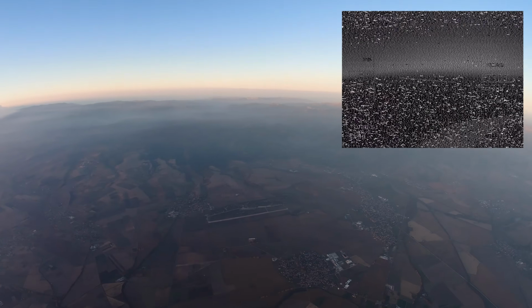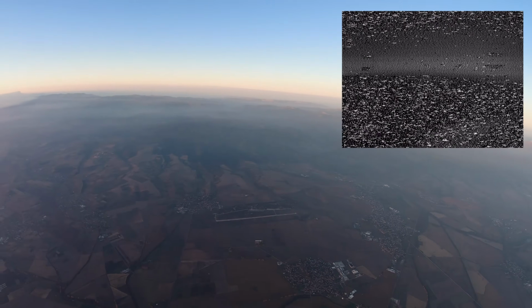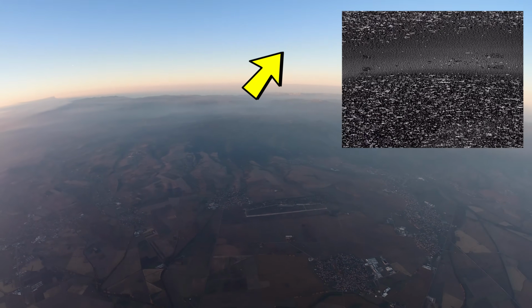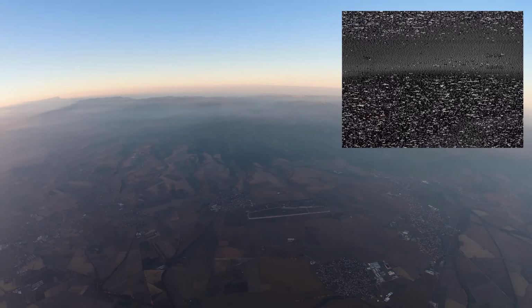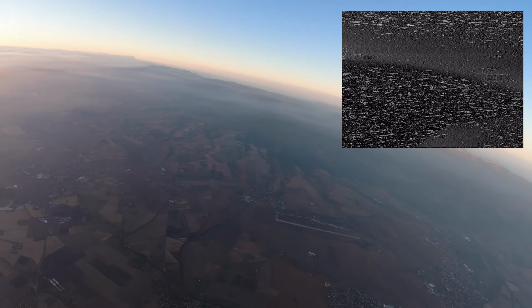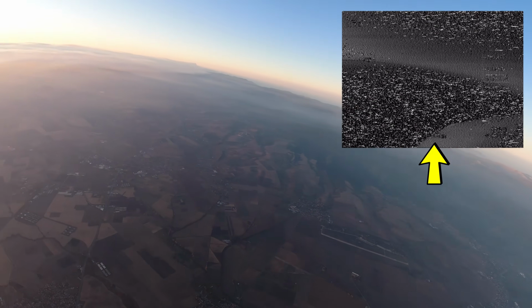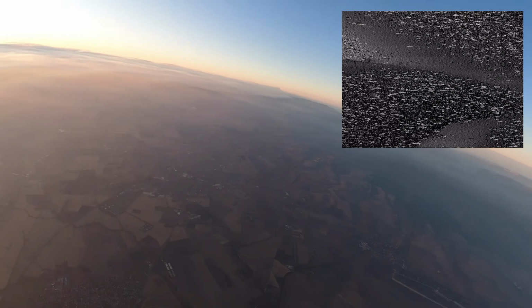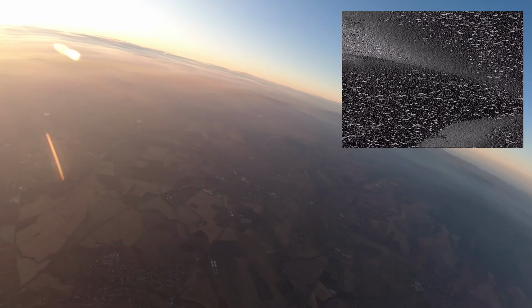More to the point, I was happy my math worked out. Following my flights with the X2 Ultimate a while back, I had calculated that jumping up from 1200 milliwatts to 2000 milliwatts, all else being equal, should get me out to around 30 kilometers, and indeed that turned out to be exactly the case. Now, I do have to apologize for the shaky video.